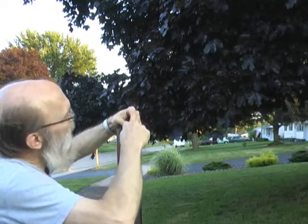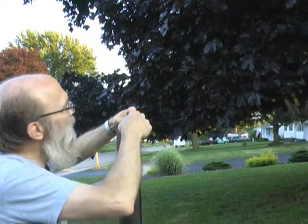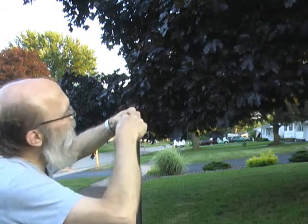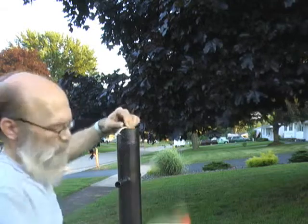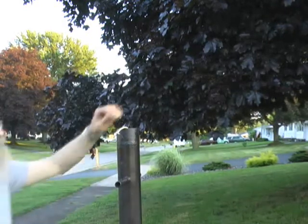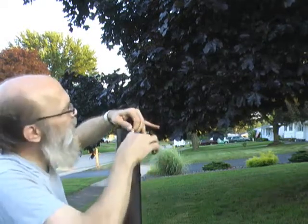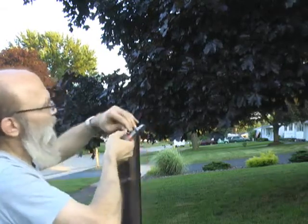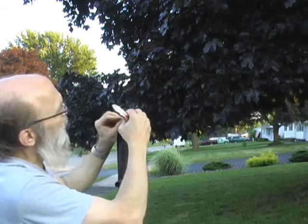And, oh yeah, this is cutting much better. All right. Now, instead of trying to cut in one deep cut, do it twice. Just pushing gently each time. And a third time if you need to. And again, with this brittle wire, I'm going to get the pliers and see what's going on here. And basically, this wire inside this pipe in the hot summertime, this wire is like in an oven. So all of the plasticizers that keep it soft and flexible have basically been cooked out of it.